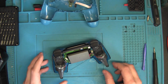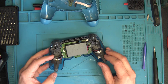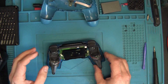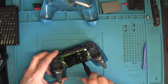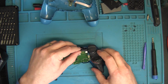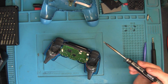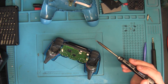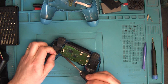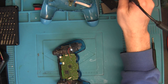On the original PS4 Sony controller, you need to remove the whole chassis to access the motors. On different third-party controllers they may differ, where you don't need to disassemble the whole thing. But on the original one you need to. There's a second ribbon cable — be careful with these ribbon cables, they break easily. You need to remove it in order to remove the PCB from the chassis. Before desoldering the wires, take a picture of the orientation of the wires so you can solder them back in the correct way.